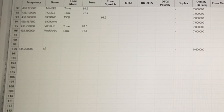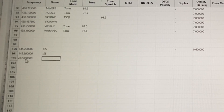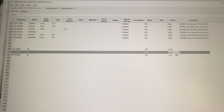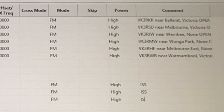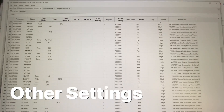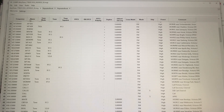I'm just going to put the International Space Station in there as well. I'll put these frequencies in here because they're quite interesting. I'll take it off scan and give it high power. And there we go - then I can upload that to the radio, it's very simple. So there's all my frequencies in now. You can use the manufacturer's software for the radio and you'll get a lot more options, but I'm going to run with CHIRP for the moment.